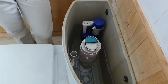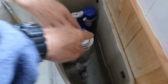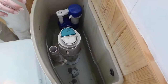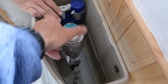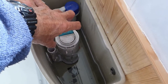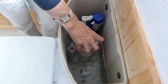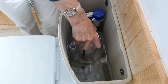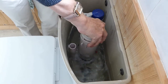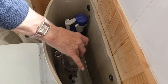So here we have our siphon and ball cock in the system. This part here is our siphon and this is our ball cock. What we need to look at is this siphon that's sticking. In this particular instance, this one just turns around clockwise about halfway and then lifts away. Clockwise — keep going, keep going, and pull. Not quite halfway, but just a little way — I felt it give and then I could just pull it out.